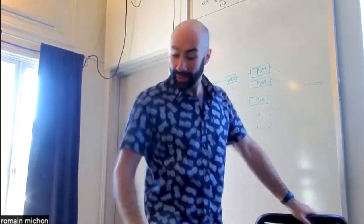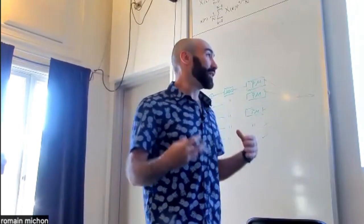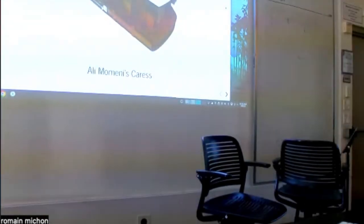340 meters per second. In this piece of wood, it's much faster because it's much stiffer. And so the time difference between a piezo here and a piezo here is not really going to be visible. There might be a difference, but the sampling rate of your audio interface, usually 48K, is not high enough to tell you precisely where the striking position is. I've seen a lot of people go down the rabbit hole trying to solve this, but they don't do it.